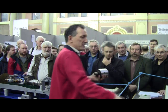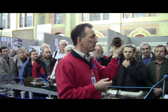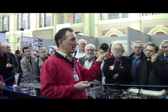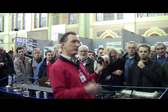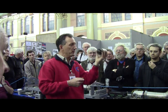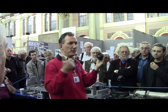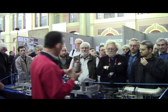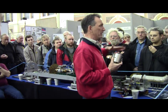That was actually the problem the original GT3 had, and why it only remained in testing and never went into service. A jet engine, to be fuel efficient, always has to work at its design speed — usually maximum power and maximum RPM. Because we're directly coupled, that means it has to be going flat out permanently. When it comes down to idle, one of these engines is nearly as thirsty sitting at idle as it is at full power. So it was just wasting fuel at signals and stops — they couldn't make it economical. The turbo-electric approach was actually better because you could make better use of that energy by putting generators in the middle of the system.